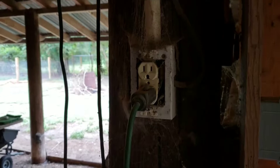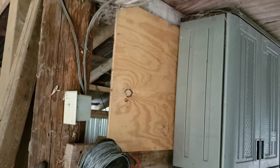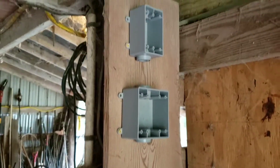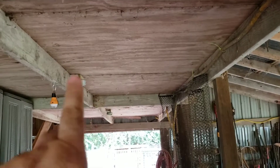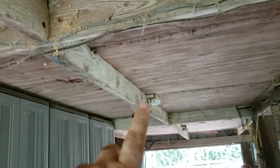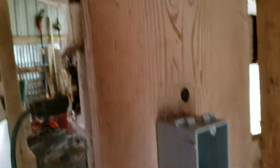This is some of the scary wiring I'm dealing with in this barn. Some of it's okay, but it's patched together very roughly and dangerous in some points, like the box I just showed. I have this piece of wood that's already here. I'm going to reroute some of the wire. This is going to be a switch right here — there are no lights underneath through this top. I've got a light here, a light there, and a light there, so I'm wiring this switch up to a double gang box for plugs.